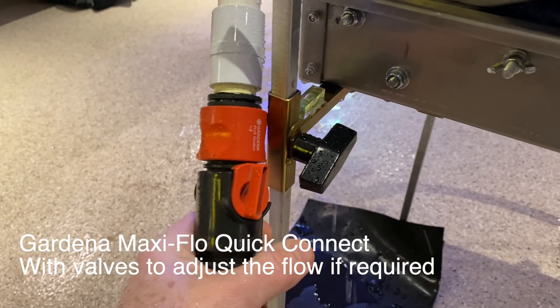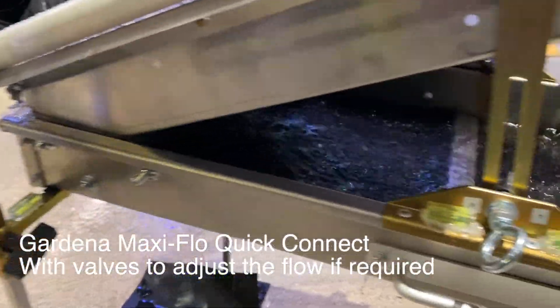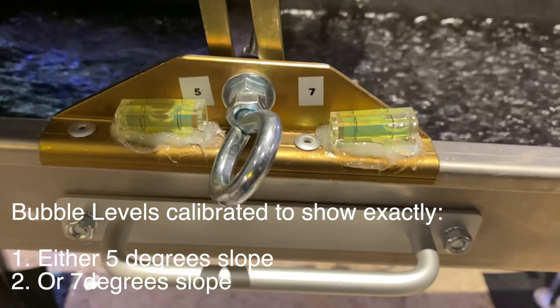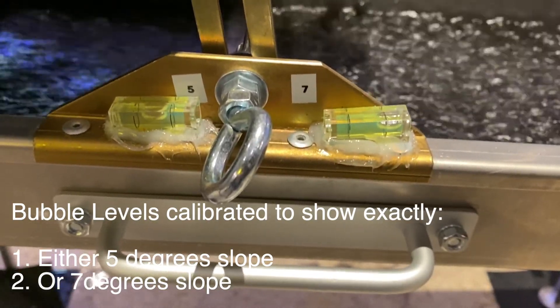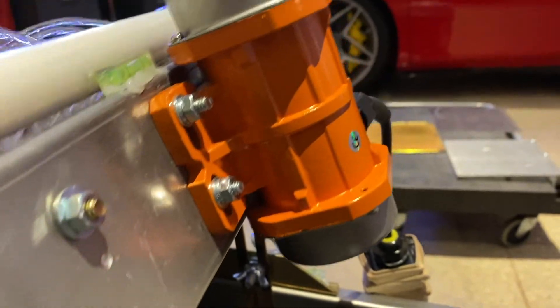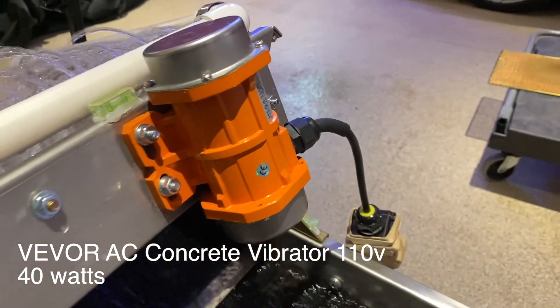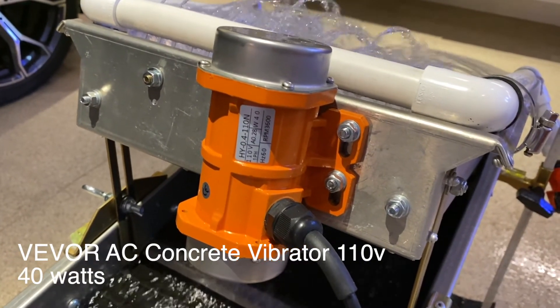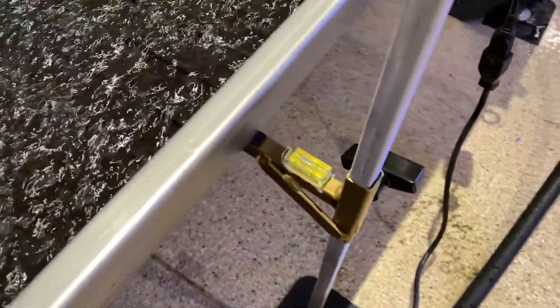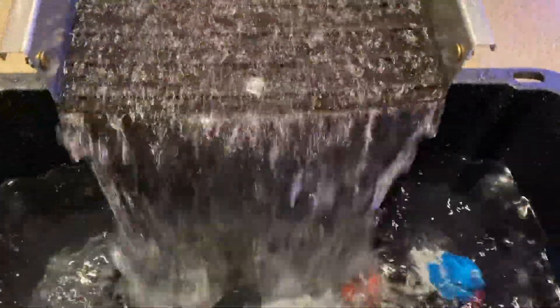Because I'm using electric pumps I need to minimize pressure drop, so I'm using a quick-connect hose — super easy to connect when you show up at the river — with a valve to adjust the flow level. I put a bubble level on it so I can be sure I've got the perfect five or seven degree inclination. The feed hopper is adjustable, and I'm using a concrete vibrator to give vibration to the feed hopper instead of a trommel. I also put another bubble level on the legs to make sure it's perfectly level when you start, which makes things way faster.